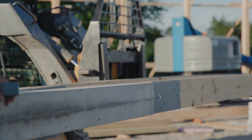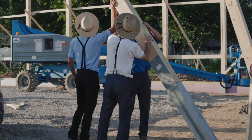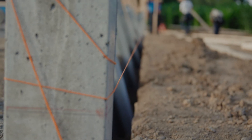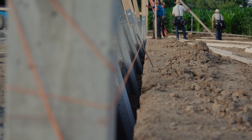The guys will treat it just like any other column — it's not that complicated. It just happens to have a permanent foundation for the base rather than a wood base. As you're putting your column in the ground in the hole, you'll still probably use a string line on the outside edge, so that as you get your column up to the edge of that string, you know that you're in line with the others.